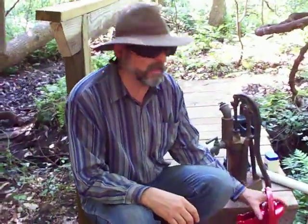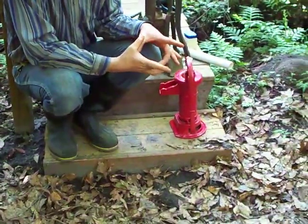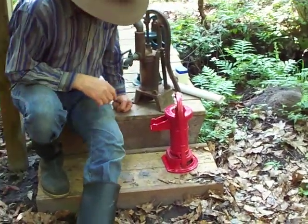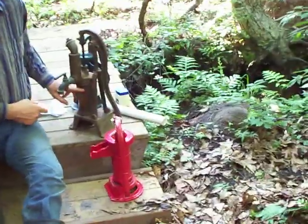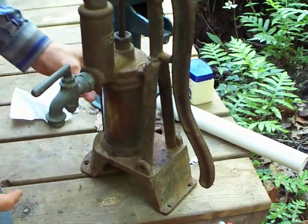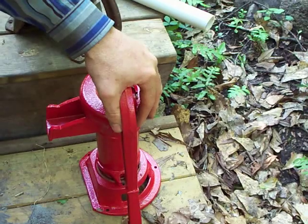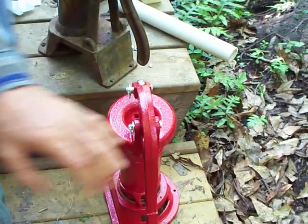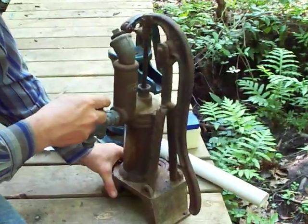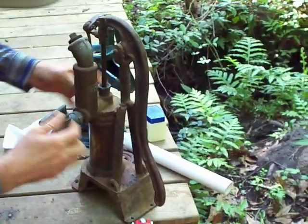This pump is exactly the same as this pump — I mean it's got the same stroke, that's the distance that it pumps, and the same bore, that's the inside diameter of this cylinder. The difference with this one is it's got a brass cylinder, so that your leathers will last longer, it'll be easier to pump, and it's smoother on the inside. These are always going to be kind of rusty. In fact, if you get a used pitcher pump, the first thing you need to do is take some sandpaper and clean the inside walls off as much as you can. Something else that's different about this is it's sealed at the top and it's got a packing nut around the shaft.